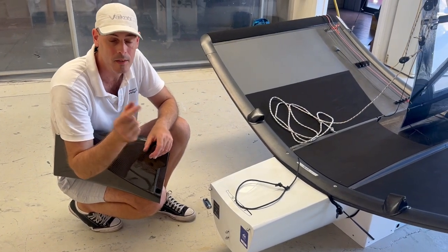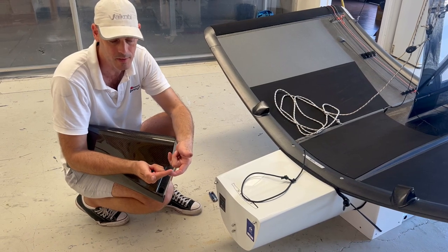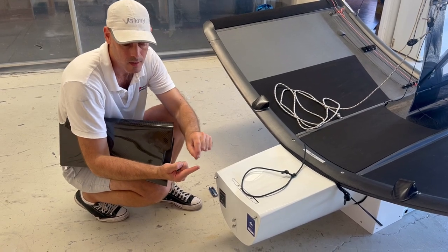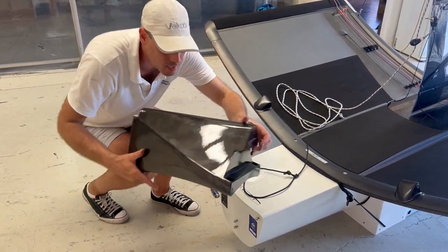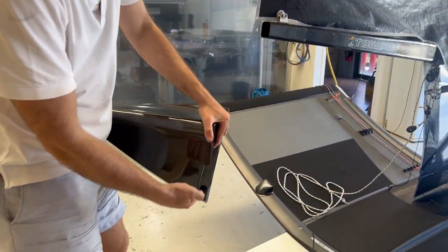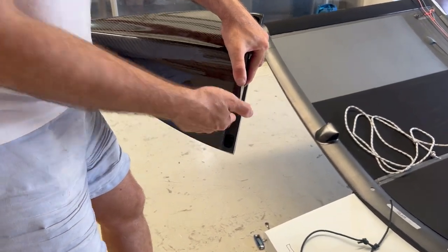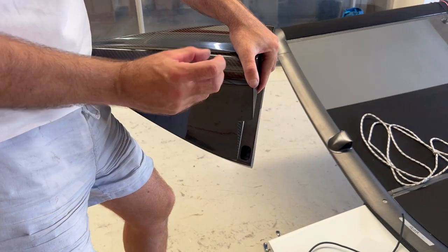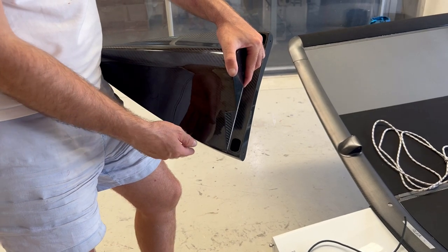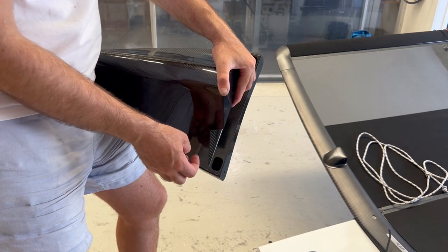The best way to start the thread is using some yellow sticky tape — wrap it around your finger, then stick the nut to your finger. When upside down, you just roll that finger and try to get the thread to bite. It only needs to bite enough to stay on. It'll take a few goes because the nut will fall into the gantry and you'll have to fish it out, but just get enough for the thread to bite.